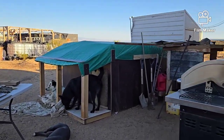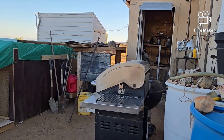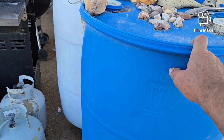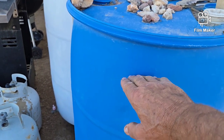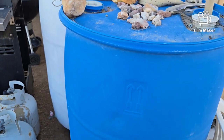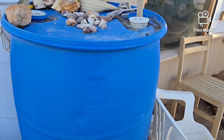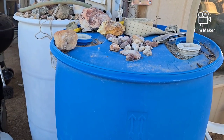So I can get about 110 plus 110, that's 220, plus 60, plus 60 — these are actually 60-gallon barrels. They call them 55-gallon because you can't ship them completely full; they're about five gallons shy when shipped. But if you fill them all the way up with rain, they hold 60 gallons each. So that's five times 60, or 300 gallons of water just off the roof of my cabin.